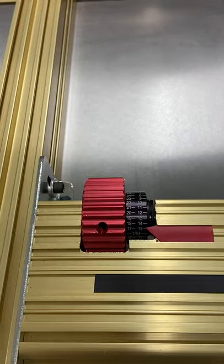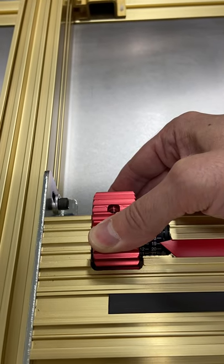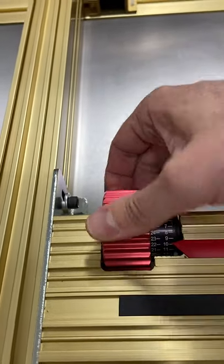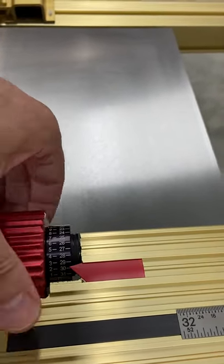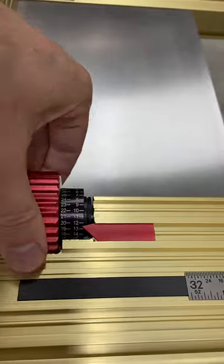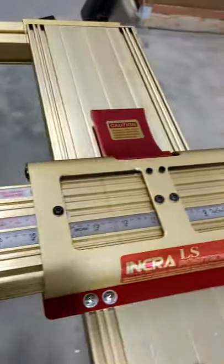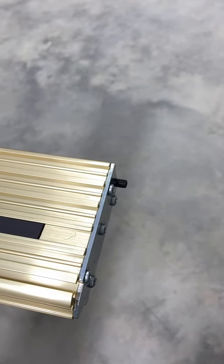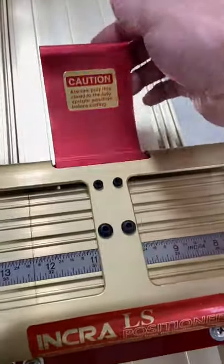The issue observed is when you rotate this — you can see how white my thumb gets, showing how much pressure I have to apply to make the rotation. Right about the zero-out position where I have it on the index, you'll hear the lead screw bind right there each time you rotate, and that's without even having this engaged, with the tension adjustment lead screw set to finger tight by loosening it, or putting it in the standard position.